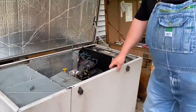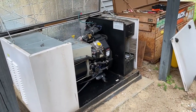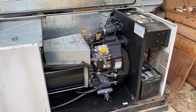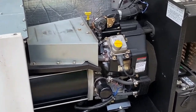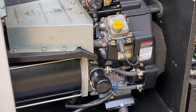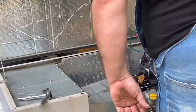This whole piece you can just pick right up and move it out of the way. That shows you pretty much everything. You've got your battery, it's a little v-twin motor — 10,000 watt generator unit. The oil filter is right out here on the side, easy to get at. They give you an oil drain hose, which is kind of cool, except like I said it's right on the ground so it's very hard to get all the oil out of it. I've figured out a plan for that after doing it three or four times.